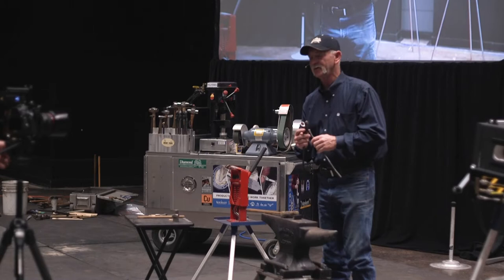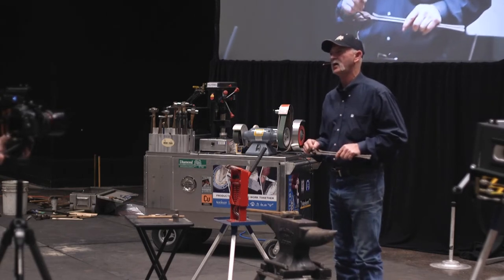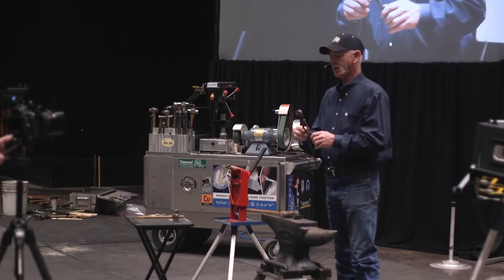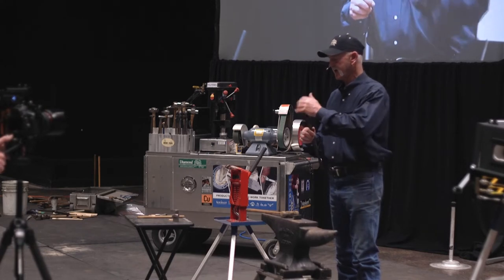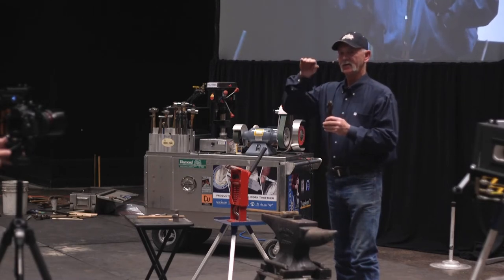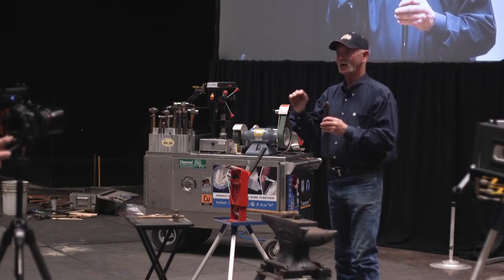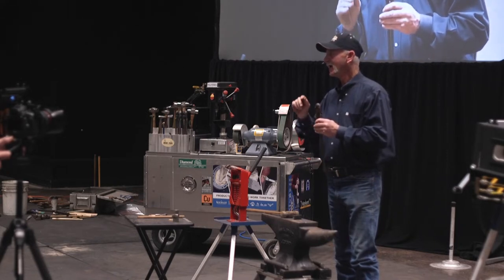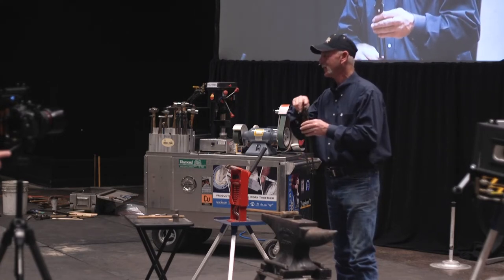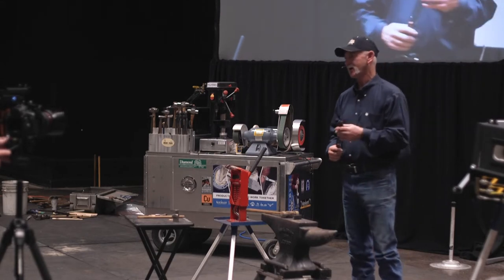So my tongs, I don't know about anybody else, but I always lock one side of the tong. I have a locking side and a hinge side. The reason is, if I set these things and that rivet gets a little bent when I'm setting it, it goes through straight and sets like that. If it's locked, wherever I set them, they're going to stay. But if it can spin in there, one minute you have a quarter inch pair of tongs, and the next minute you have a pair of 3/8 because the rivet has spun around in the tong. Anybody ever had that happen? I'm sure somebody has. I know I have.